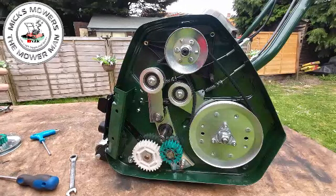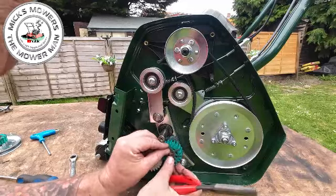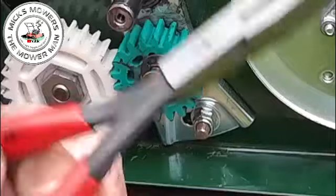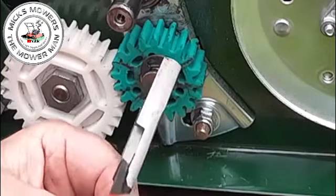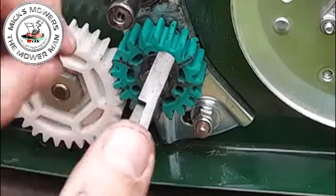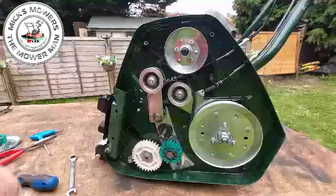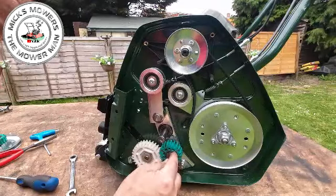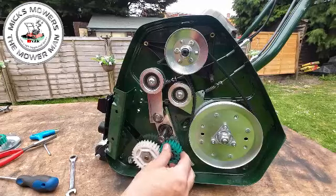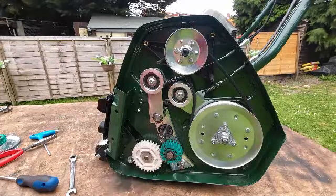To replace it couldn't be easier - just slide the new gearing on. Mind your fingers. Once that's on, get your C-clip. Here's a Mixed Mowers top trick: get your C-clip and offer it where it needs to be. With a pair of long-nose or stubby-nose pliers, just bridge the top of the C-clip, hold your fingers either side, push down and it goes on. If you try and whack it on with a screwdriver, trust me it will shoot off. Once it's in place, recheck that your gearing is correct.